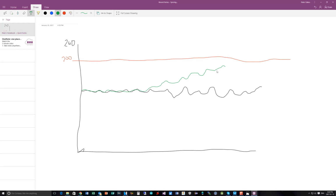I'm talking about it being a motor, but it could be anything. Even though it's not gone over an alarm threshold, it could be indicating that something is starting to fail. By monitoring the load, whether it be the current or the power or whatever it may be, over time and putting it into your analytics, you can actually decide to do some preventative maintenance. So maybe when it gets to this level, you schedule somebody to go in and do a service on the motor or replace some components or whatever it might be to remediate the problem and get it back into its normal operating range.